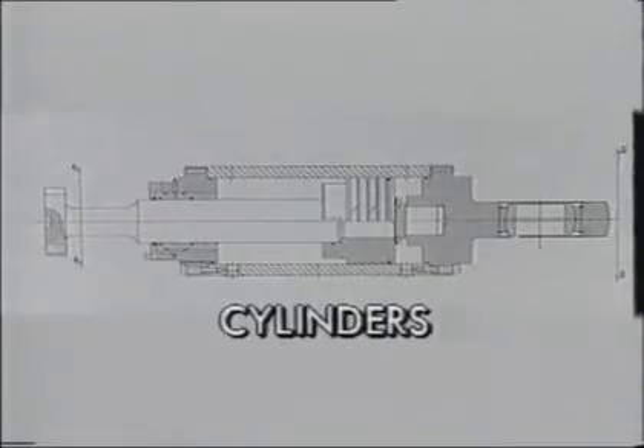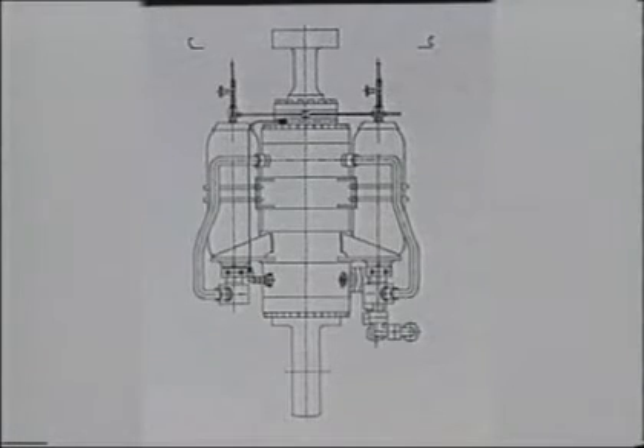Each cylinder has scraping rings which remove dust and dirt from the piston. This reduces the quantity of dust which enters the hydraulic system. In addition, there are seals within the cylinders, which are also subject to wear. These seals are placed just behind the scraping rings. The wear which has occurred at these rings can be controlled by manometer hose 102. The hose can be released from the bottom of the cylinder. The quantity of oil which leaks past the seal will indicate the state of these seals. The greater the volume expelled, the more worn the seals are. If this volume is significantly greater than was the case when the seals were new, these seals should be renewed.